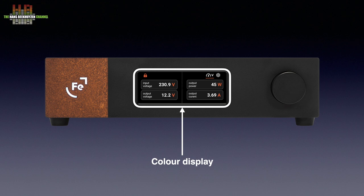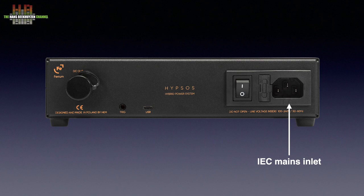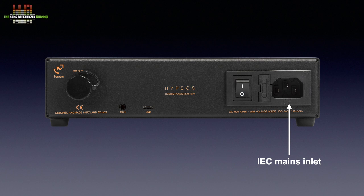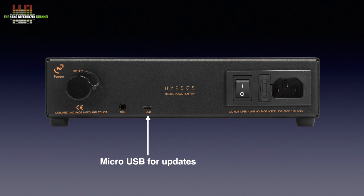The coloured display shows the nominal output voltage, the actual output voltage, the power output in watts, and the output current in amperes. The display on this photo differs slightly from the current model in that it shows the input voltage instead of the nominal output voltage. On the left is the FE logo that is lit during operation and will dim in standby. On the rear we see the IEC mains input, the fuse holder, and the power switch in one unit that internally also contains a two-stage mains filter. The micro USB is for updating the power supply using a Windows 10 computer — no support for Mac OS or Linux.